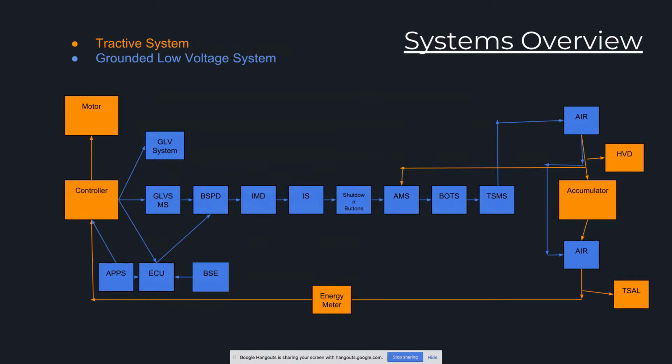Yeah, I can pull those up, but I was thinking, is there any reason that we couldn't use a mixture of the two? Batteries and supercaps have different kinds of advantages. The supercapacitors are really good at sourcing current real quick. However, as soon as you start drawing current from a supercapacitor, the voltage starts dropping, whereas because a battery relies on a chemical store that you're constantly depleting, you have a constant voltage.